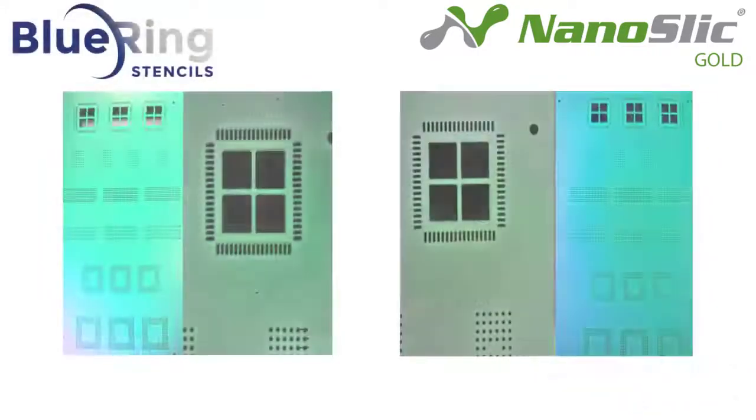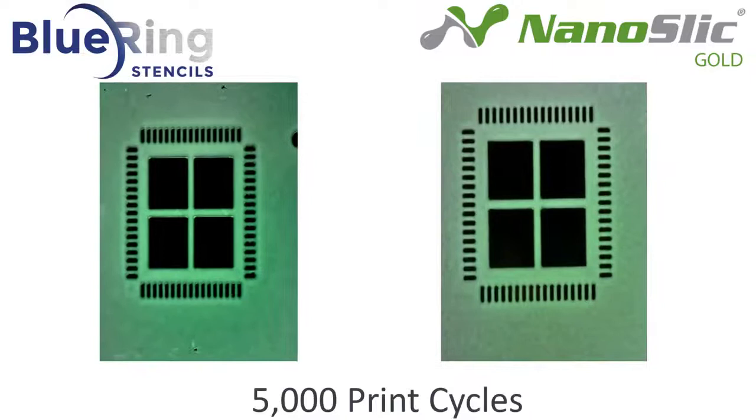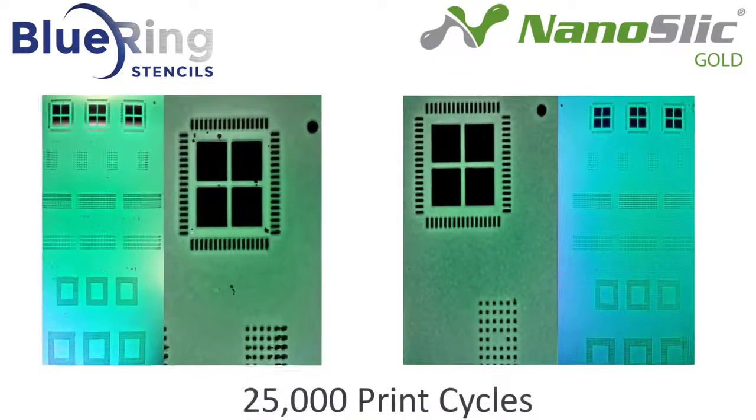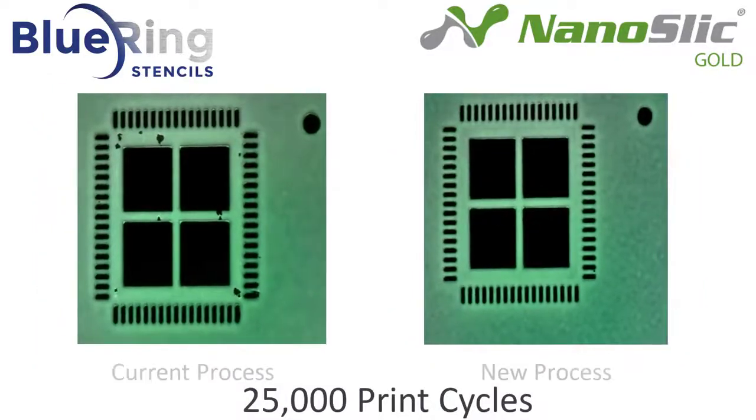In other words, it takes over 360% more force to remove our new coating technology than our current coating. How did this new coating hold up in our print simulator? Let's take a look. These first images are taken after 5,000 print cycles. You can see a few chips in the current process image and none in the new modified surface coating. Again, looking at images of the same stencils after 25,000 prints, you can see even more chipping on the current process images, and the modified surface coating still looks brand new.